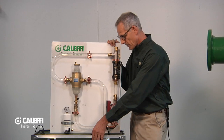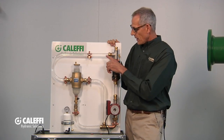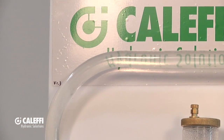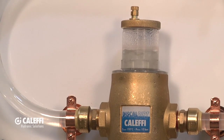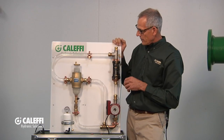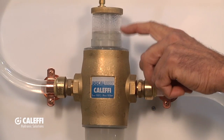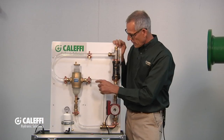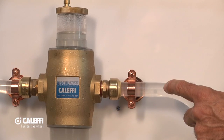Now watch what happens when I turn the air on. It takes a second here — we've got the air pump in the back, it'll get up to speed. Look at the amount of air that we're pushing into this system and how quickly it comes out of solution over here. Even at different speeds, lower velocity — we're shoving quite a bit of air into that. I forget how many CFM — cubic feet per minute — we're putting in there. And you'll see virtually no air is getting through that Disco Dirt Separator right now.